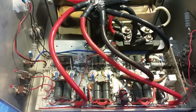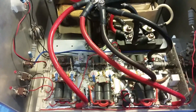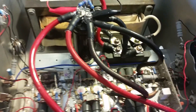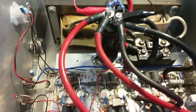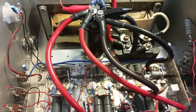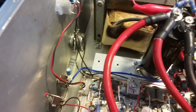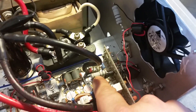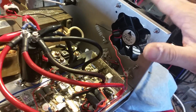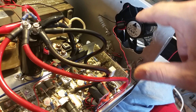Mr. House Builder had a four 50-amp bridge rectifier blown — all four of them — and a 30,000 microfarad cap that was blown. There were a few other things: the variable had some bad spots in it, there was a padding resistor that was blown as well, and the fan that was on there just wasn't big enough.